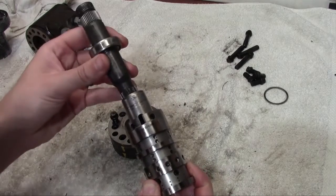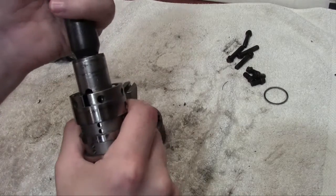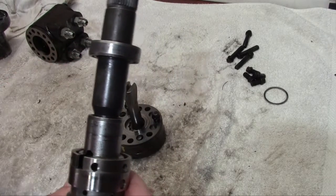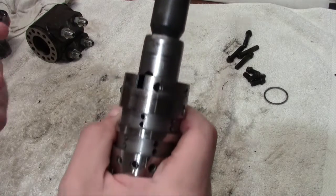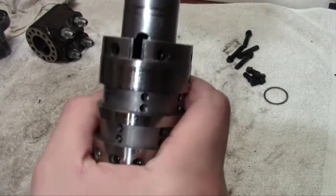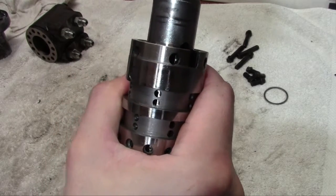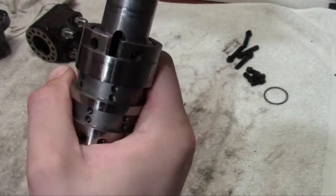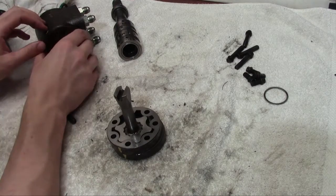You can actually see if I take this and put the steering shaft back in there, these springs in here actually allow it to rotate one way or the other. When you're at neutral position like this, all the valves are open so everything — left and right cylinder — is getting pressure from the pump. Then when you're turning left, it blocks off the flow to one side and opens the flow to that other side. Turning it the other way closes that side and opens up this side. This is the manifold block that pairs up with this bolt pattern, goes on there like that and just lines up with all those holes.